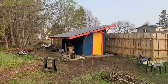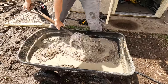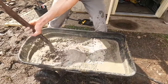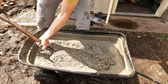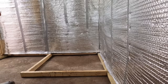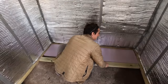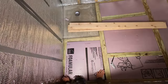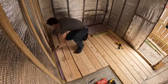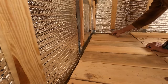How about some paint? Suddenly that old steel siding looks brand new. Now it's time to think about the floor. I plan to build an insulated floor with foam board and cedar planks, which means the stove will need to be about two to three inches higher, so I poured a small patch of cement where the stove will go. Now I can put down the treated 2x4s and the foam board to insulate the floor. The 2x4s are not attached to the cement — the cedar deck planks will just get screwed into the 2x4s, and the whole thing is held in just fine with gravity and friction.